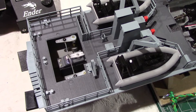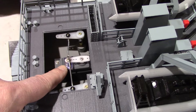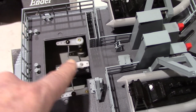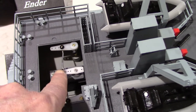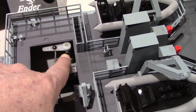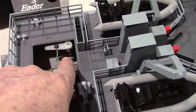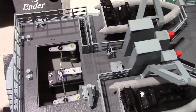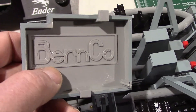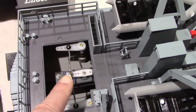Now I've removed the superstructure so we can see inside. Here is the rudder assembly. I had a high-torque servo from Hobby King and I installed it vertically for easy access to the screws. Because of that it's a little high, but you also want the tubes to be as high as possible above the waterline to minimize water leakage inside this compartment. To clear the screw I had to build a riser — you can see the Bernco logo here as well.